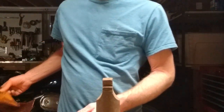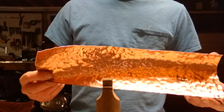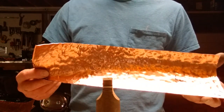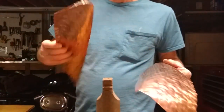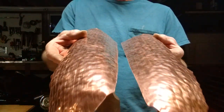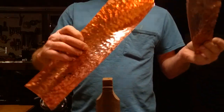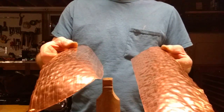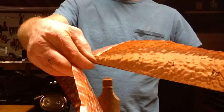Okay, good evening, YouTube. TK Tin Man. I started my orca boat replica from the movie Jaws. I cut out two square pieces of copper. I scribed boards on them while they were flat and smooth. I hammered from the inside with a ball peen hammer on a low pile carpet on a concrete floor of my shop. And now I'm about to turn up the edge a 16th of an inch flat on the front bow so I can mate them two together.